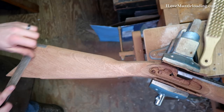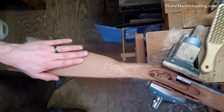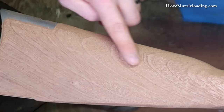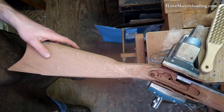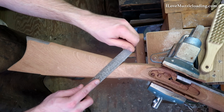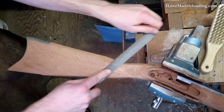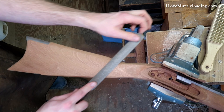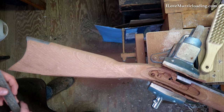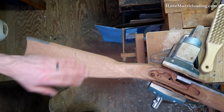As I'm working this, I'll go through and rub my hand across this top plane here after every few strokes, just to make sure I don't have any weird ridges or anything in there. I have a little bit of a ridge running right along here, which represents the balance between how I've been working here and up here. So I want to go in and balance that line out, trying to keep my rasp as in contact with the stock as I can. The stock is curved, but we just want to be cognizant of that as we're working so we don't get any weird wavy patterns. We don't mind if there's some grain that looks like a wave, but we don't want any physical waves.